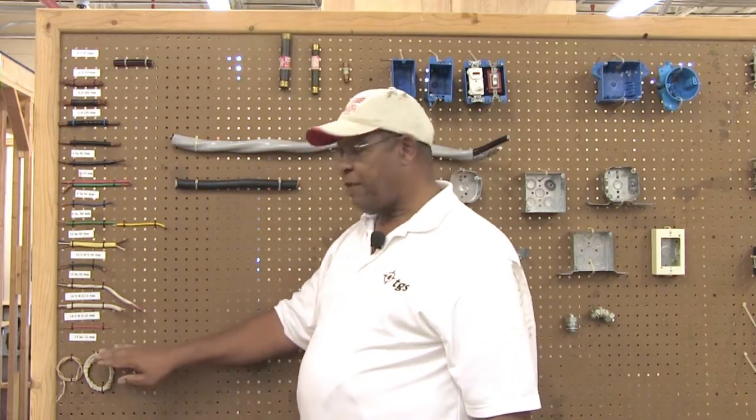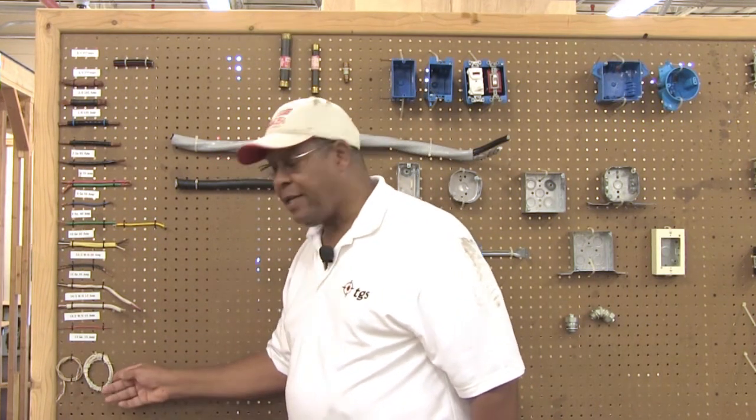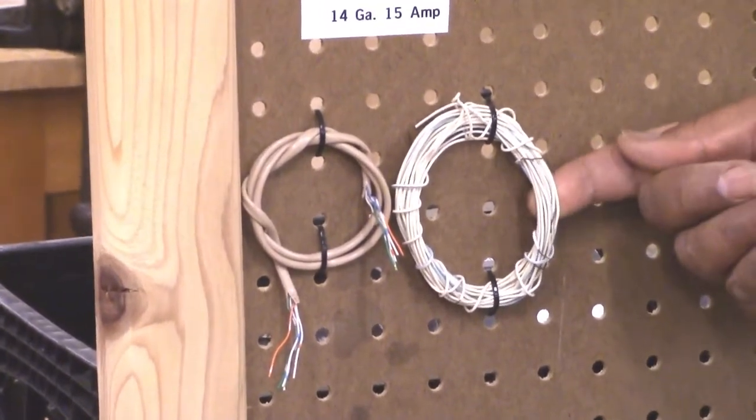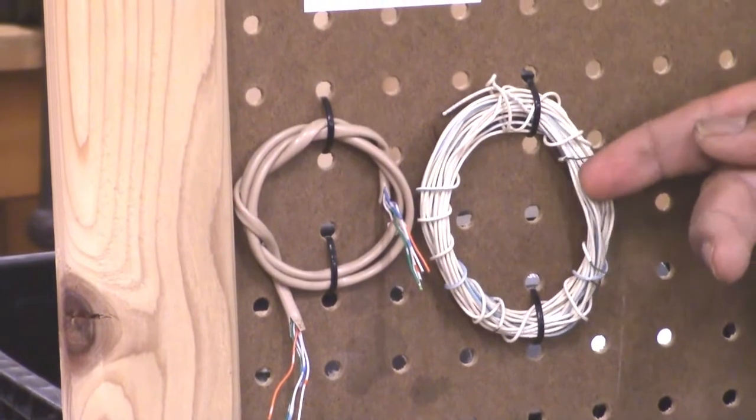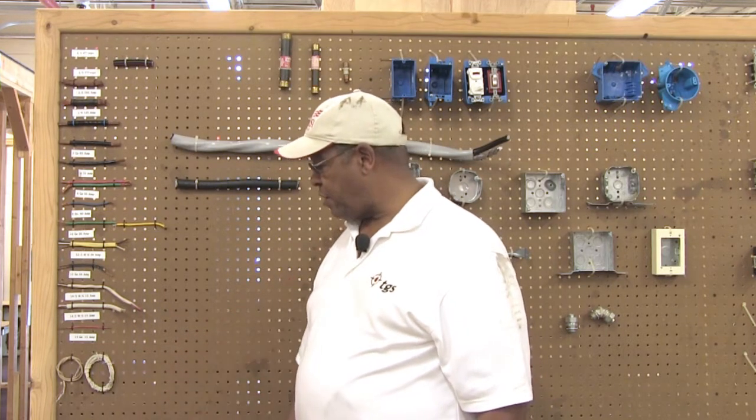Over on this side, we'll start at the bottom and talk about the various types of conductors sometimes used in the home for various applications. Down here at the very bottom we have a very light, small wire which is about 18 to 22 gauge as it relates to the American Wire Gauge, which is what we use in the industry to determine the actual wire size. This 18 to 22 gauge wire is used for communications — some for your HVAC system in terms of the 24 volts that goes to your condensing unit by way of the thermostat as a control. Other communication wire will be used for the doorbell system in your home, which is 16 volts, and then for internet service, which is a CAT 6 or CAT 5 cable.